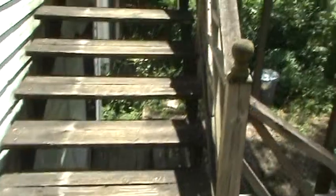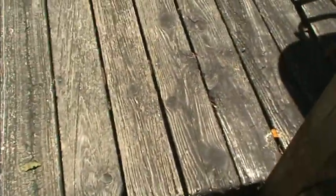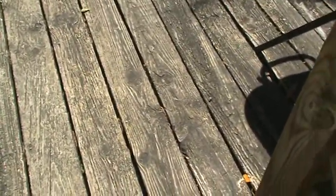That is the B side of the property. On the A side, you've got the same issue with the steps — all these stair treads need to be replaced. Put a central stringer in the middle of this thing; all the carpenters will cut it on site. This board right here is ready to snap and I can feel it flexing under my weight — that's only part of my weight. I'd replace all those. The edges are starting to rot here in this deck, but if the owner can pressure wash this stuff and come back and stain it in the fall sometime, or whenever funds permit, he'll be able to save most of this stuff.